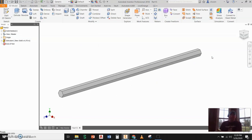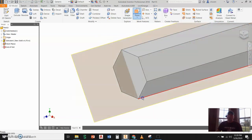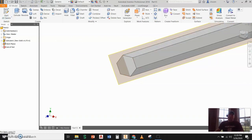Now at the end of this, we're going to have to bring this to a point. Every time we put a pencil into a sharpener, we're basically doing what we're about to do here in Revolve. In order to do this, I'm going to zoom in, go to Plane, pick on an edge, and then pick on the edge that is completely across from it. Now we have a work plane going diagonal, from corner to corner.